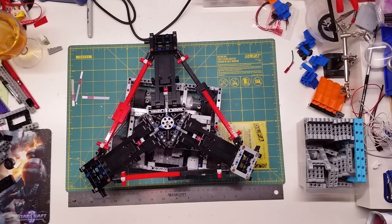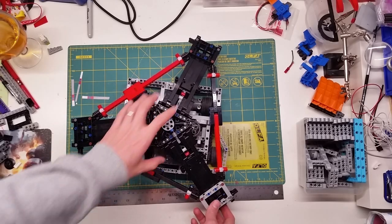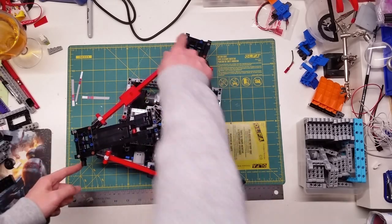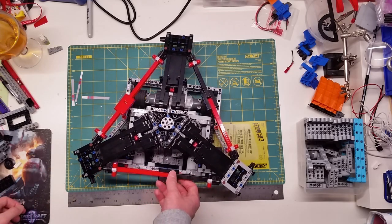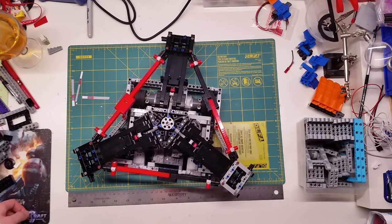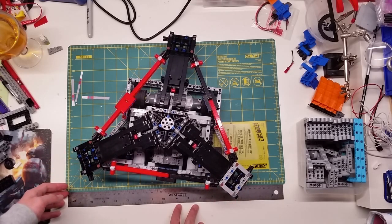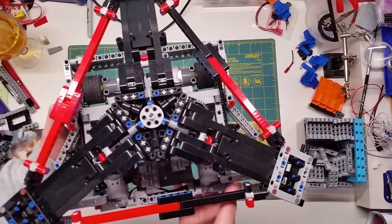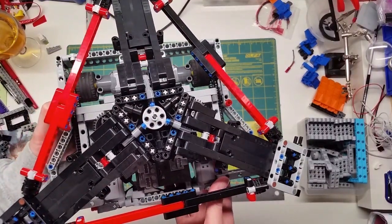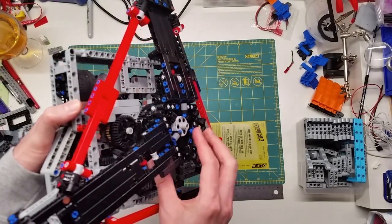Let's go over the weapon. It's the classic Whyachi design tri-bar. It's got 3 points of contact. It spins at about 1140 RPM, and it's got a diameter of 40 centimeters. It weighs 272 grams, and I calculated the energy to be about 24 joules.